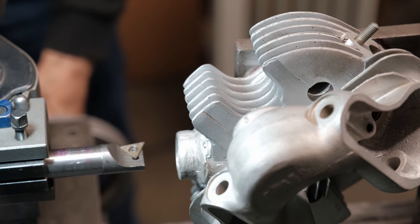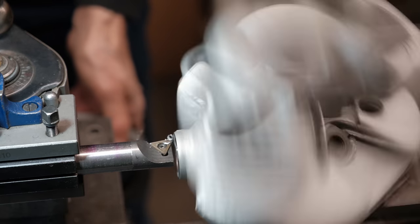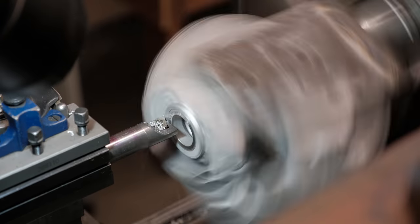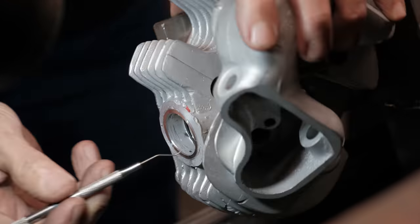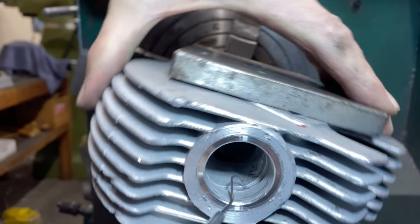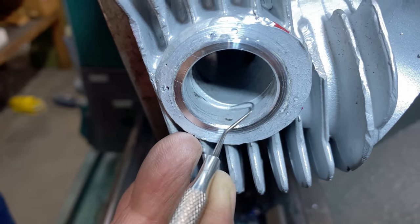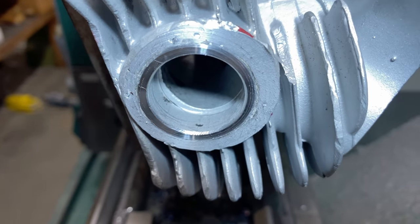Let's see what happens — see how it cuts, if there's vibration. What I wanted to show you here is that on the exhaust port, it's always about the flow. Can you see all this? The whole way around there's a huge gap — very bad. So when we make an insert, we want the insert to go right up to that shoulder so there's just a nice smooth flow of exhaust gas.